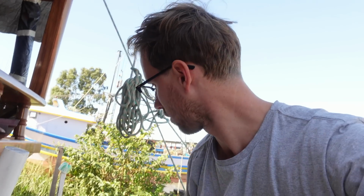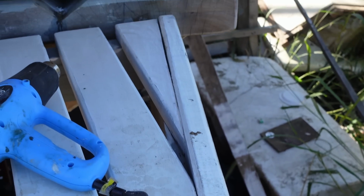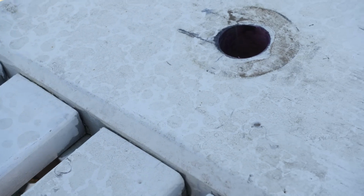Now what we want to do is leave it completely ready to receive its final layer, just like the inside of the bulwark by the deck. So the plan is, I've just gone over with the compressor gun, cleaning all the little seams and gaps where dirt can get in and water can get trapped. Then I have gone over with a compressor gun with ethanol so it gets in all the crooks and crannies. That will help dry out all the oily bits and also whatever's humid.